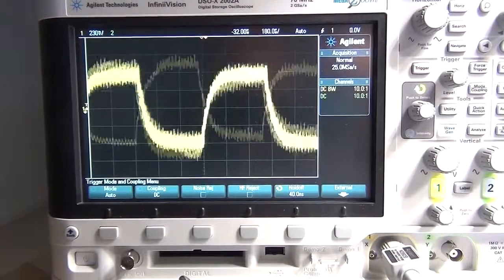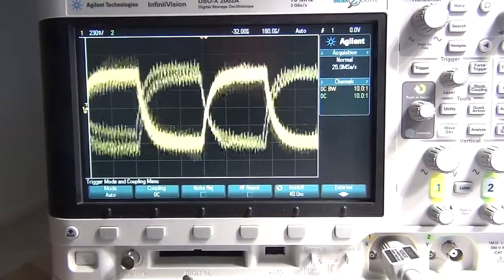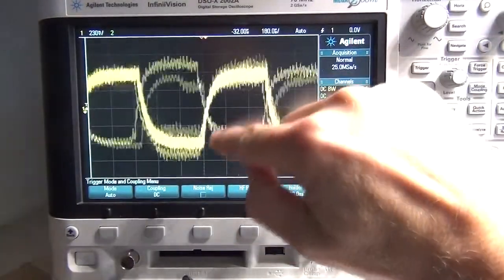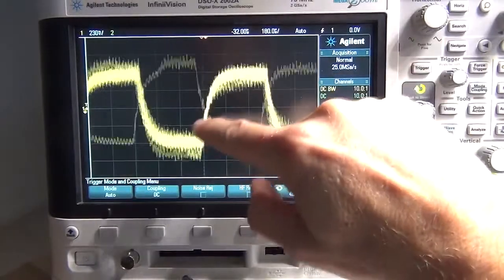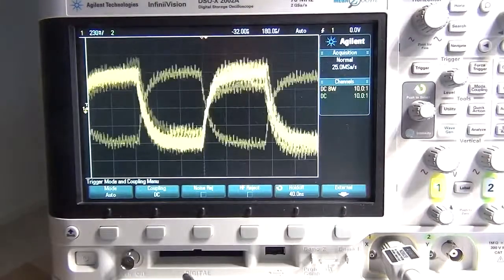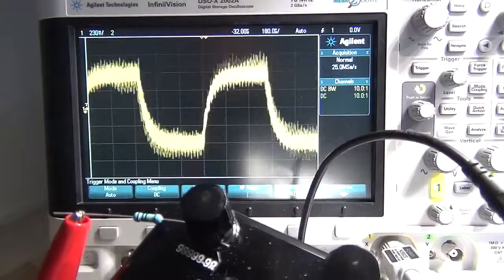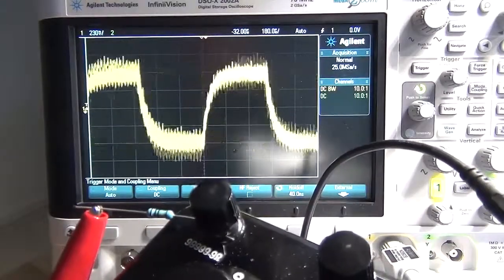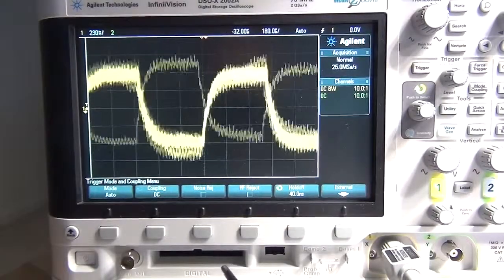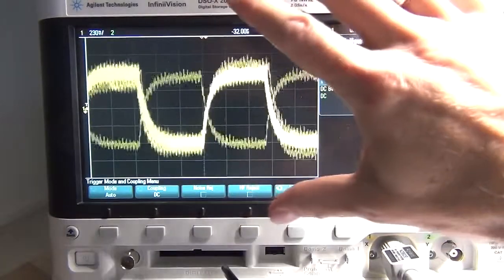Right, so as I said, you're coming along on the ride with me. So a couple of challenges. What I've done, if you can see from this wonderful noisy signal on my scope, there does seem to be a nice curve profile, but there's a lot of noise and bobbling around there. How I've achieved that, I just took a chance and pulled out a 1 meg resistor, and I've simply tapped that onto the end of my decade resistor box. That seems to be giving us that curve, but the signal is noisy.